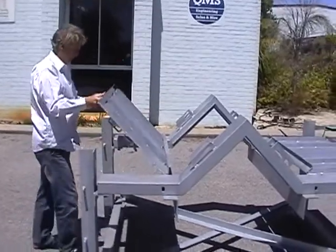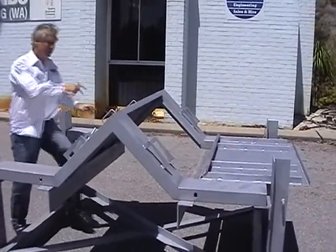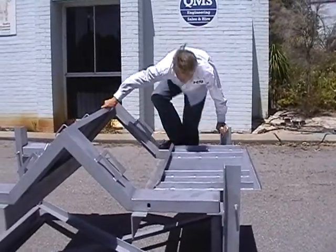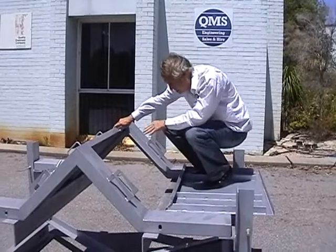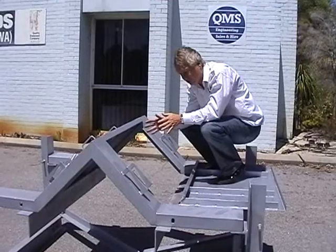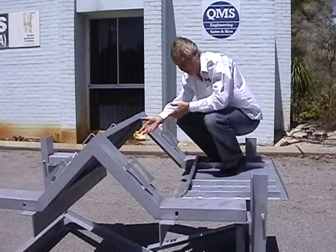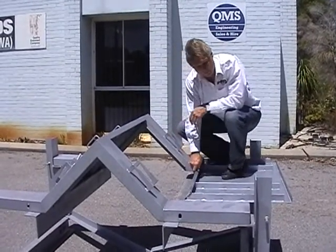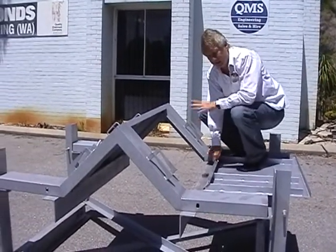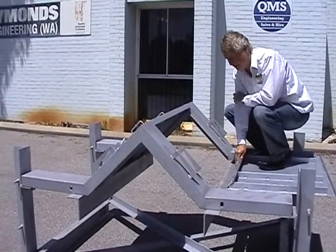To close it up, nice and simply, we just pop it up again like so. I'll climb on this one just to show you how simple it is. All we do is climb on top of the covers. We can inspect the belt, inspect the actual skirt line and see if they need changing. If they need changing we climb on the belt. This offers a nice platform to get on and off the belt. If we need to, we can actually put handrail stanchions on here, or a harness or a rope to make it safe. This offers a great option to get on and inspect the existing skirts and the belt.